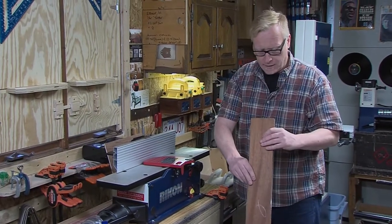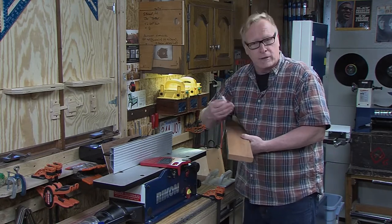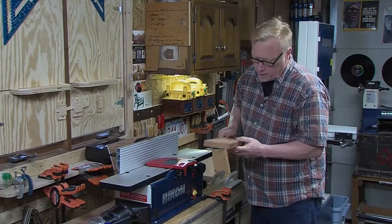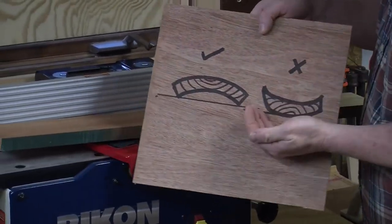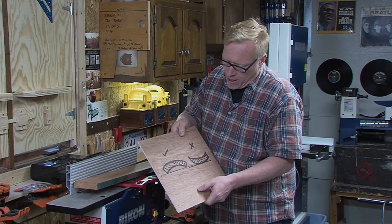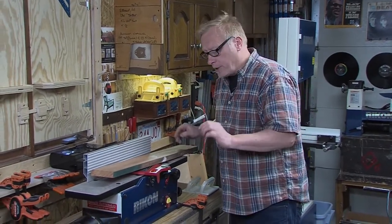There's a little slight cup in here. With mahogany, you don't want to use just a regular pencil — your lines can get lost or blurred. So grab a piece of chalk or a white pencil crayon. I'm just going to put a mark on there to tell me which face I want down. We want cup down: if you put cup up, it's going to rock on you and you'll have problems controlling the board on the jointer, plus you end up cutting off more material than necessary. Cup down sits on the jointer bed better and you're cutting away less material. I'm going to fire up the dust collection, clean up that face, and then put it through the planer and bring it down to a half-inch thickness.